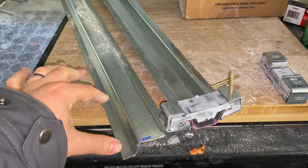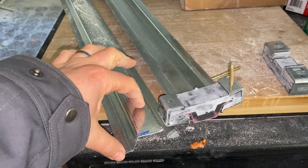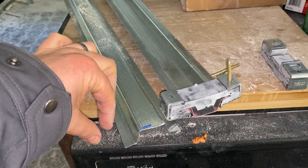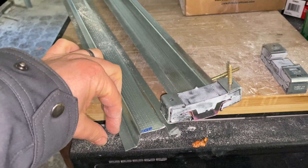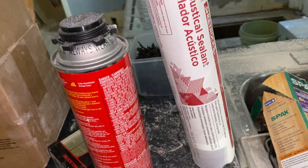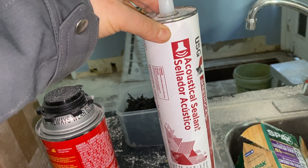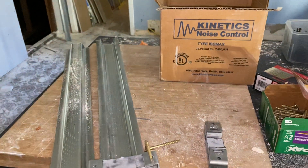You don't want more than six inches from the edge, but you can put them pretty close. Your sheetrock on the ceiling should not touch the wall — keep a small gap, about an eighth or a quarter inch, that you fill with acoustic caulking. This acoustic sealant is basically like caulk that never fully hardens, and by staying a little soft it helps prevent the transmission of noise. Hope that's helpful.